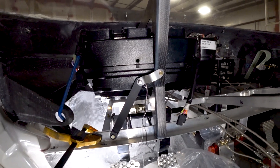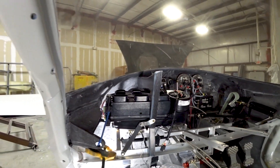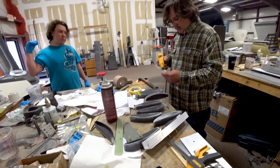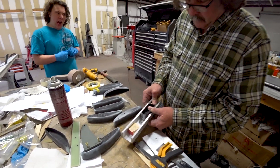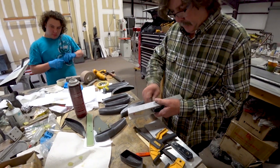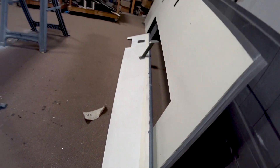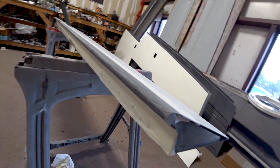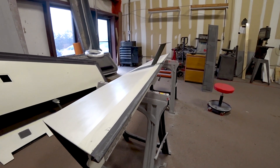Back in the cabin now — I've got the AC unit fitted into place. When Dan was around he created some brackets for this, but they'd never been fully fitted, so I cleaned those up and got them all anchored. Meanwhile Jeff is drilling out the ribs to match those elevator arms — you'll get a little surprise about those in a minute. There's one of the ailerons that's had the leading edge closed out with a thin carbon layup, and the other one is in process, which will pretty much finish out those ailerons.